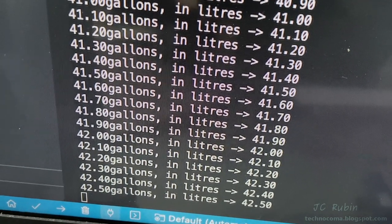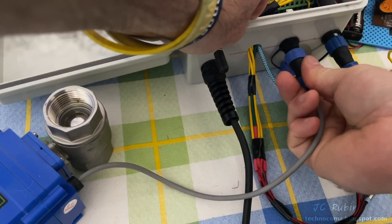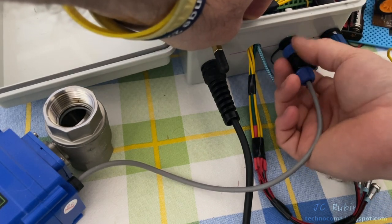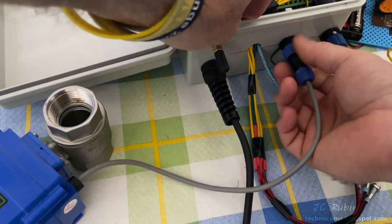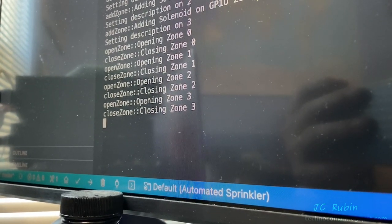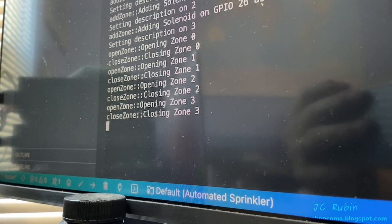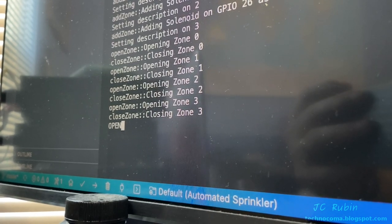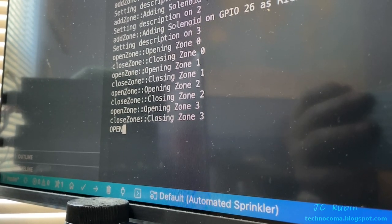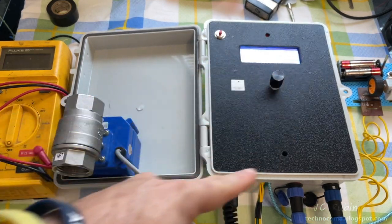The water meter emulator appears to be working fine. I then wired up the five-wire water valve into its connector. The fact that it opened immediately when I plugged it in told me two of the wires were backwards — I went in and fixed it. I added open and close to the diagnostic with a check on the sensor for both states. It fully opened and open was correctly sensed; it fully closed and closed was correctly sensed.